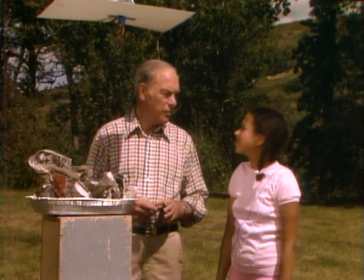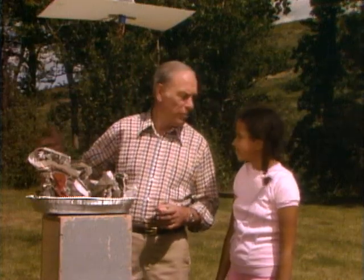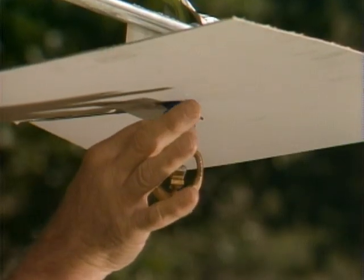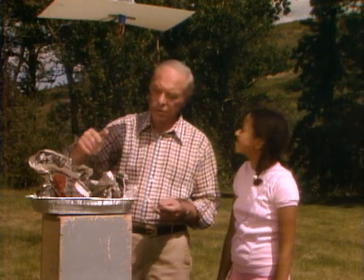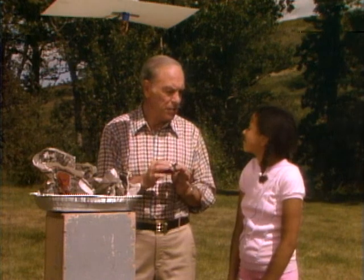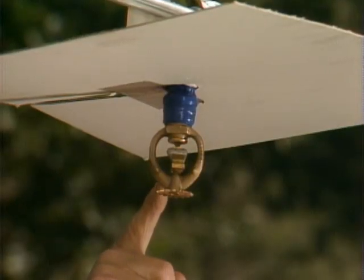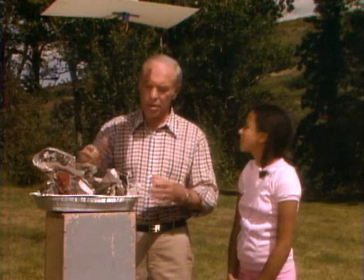In case a fire starts? Yeah. Have you ever seen one go off? No, I've never seen one. Well, wouldn't it be a good idea to set one off? I borrowed a stand so I could set the sprinkler up here and pretend it's a ceiling. I've got it hooked up to the garden hose. When the fire gets up here, that little silver section is a special combination of metals that engineers can mix to melt at any temperature they want. That one's set at 160 degrees, so the minute it gets to 160 degrees, it's going to fall away, release the mechanism, and out will come water to hopefully put out the fire.